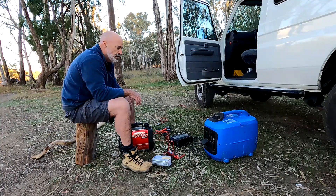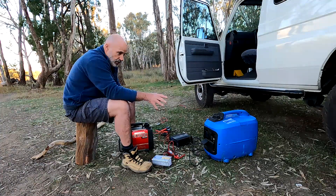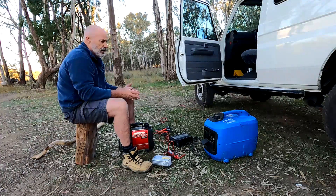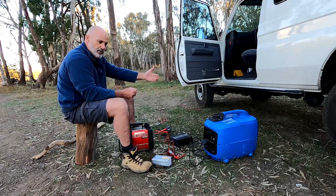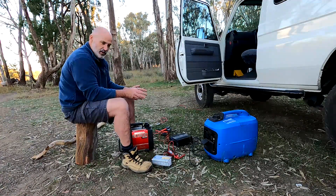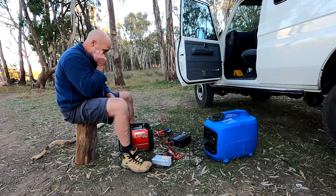This small generator doesn't actually have any 12-volt output. The Honda, the Yamaha — they're all the same in that the amperage differs slightly, but the output is unregulated. When I say unregulated, it's just a straight 12 volt smashing out and you connect it to your battery — it's hammering your battery with 12 volt. There's no regulation. In your caravan or car alternator there's electronics that stop the batteries from overcharging, boiling them, and cooking them.